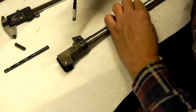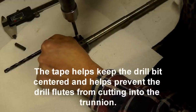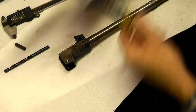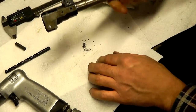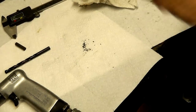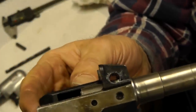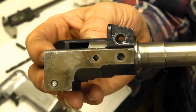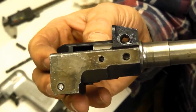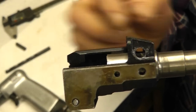Even though you've got tape on there, the drill bit is going to tend to want to move. Got that hole started. Now you'll see what I mean - drilling a flat spot. The drill bit is not trying to walk around the barrel as it would with a regular point on it. I'm going to continue drilling from this side, and if I have to, I'll resharpen the bit and drill from the opposite side. I always try to drill from both sides toward the middle.